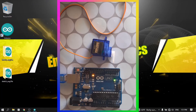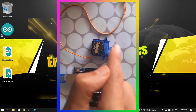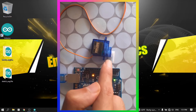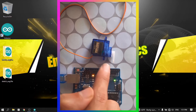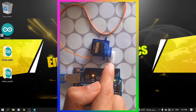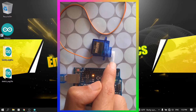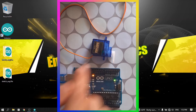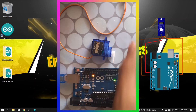If you don't know what a servo motor is, basically it's a motor that can rotate, but it can't rotate around itself over and over again — it has a limiting range. For example, this servo can rotate only between 0 and 180 degrees. We have this little arm that we can rotate, and we're going to use a built-in function called write, where we give it the angle like 0 or 90 degrees and the servo will go to that position.